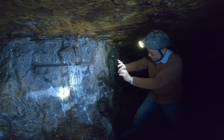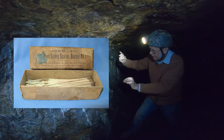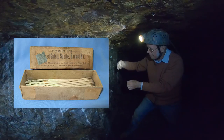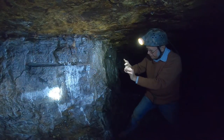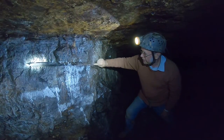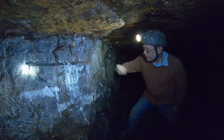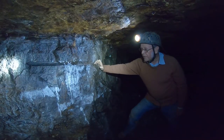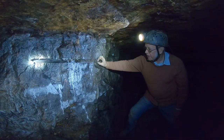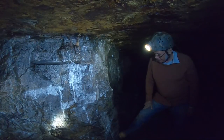The next thing was to take a squib. A squib was like a firecracker — a long thin straw. Later on, the patent squibs were soaked in a sort of sulphur solution so they would burn slowly, but there was a small amount of gunpowder at one end of the squib. You put the squib into the hole, into this long tapering hole left by the pricker, with the end of the squib sticking out, and then the end of the squib was lit. All being well, that would give a few seconds as the squib burnt down before it exploded.